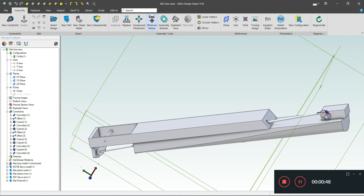And it's interesting that the next servo forward, which obviously has a longer arm to go through a hole on the other side, is most probably more flexible than the short one here, which would be much more rigid between the two support points and therefore more prone to binding. At least that's my theory.